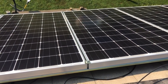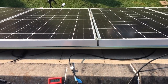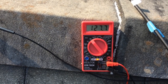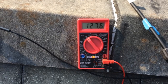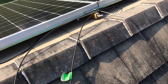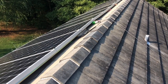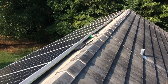If you watched my live stream Sunday night, remember I said string number four was not working at the disconnector box. First thing I did was check by the connector box - no juice there. So I came up and disconnected the MC4 connectors and I am getting 127 volts right here at the panel. So it seems obvious after troubleshooting that the problem is in the wire I ran down through the conduit. That's a problem because it can be a real bear to get out, and I'm not going to be able to run another wire down through there because it's packed too tight. What I'll most likely have to do is run the wire next to the conduit and zip tie it to the back of it.